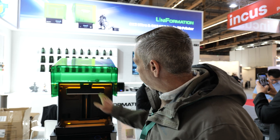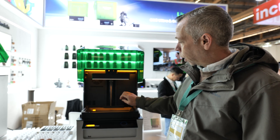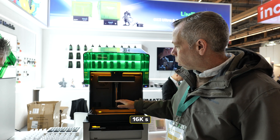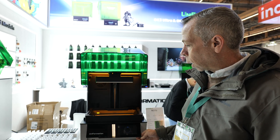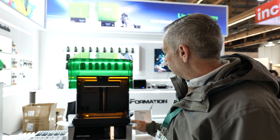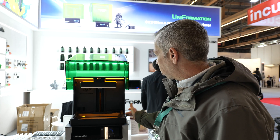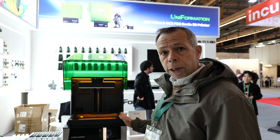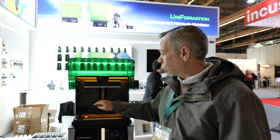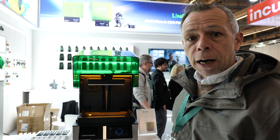I've just had an interesting chat with Ella from Uniformation. She ran over some of the key aspects of the GK3 Pro. We have auto resin fill and a ball lead screw on the Pro version, while the standard GK3 has a TR lead screw. We also have a high-quality screen and a very nice touch panel tiltable display unit. This model comes with a spirit level bubble so you can wind the feet to level the machine, the same vat locking mechanism as the GK3 Ultra, and resin detection. The build plate clips off and locks in place to drain resin back into the vat.